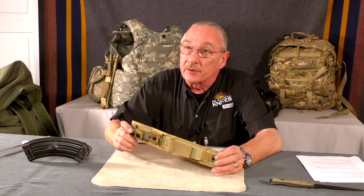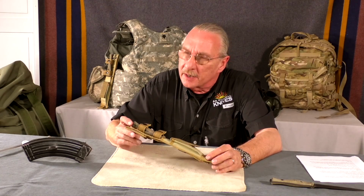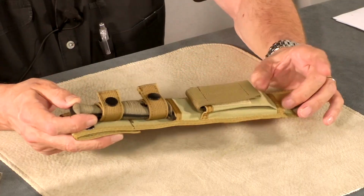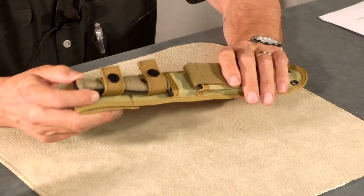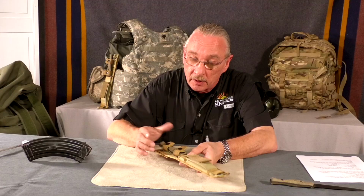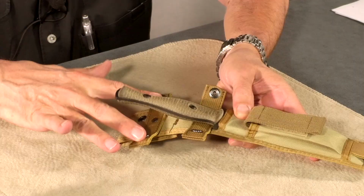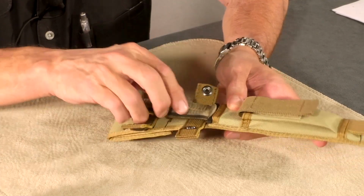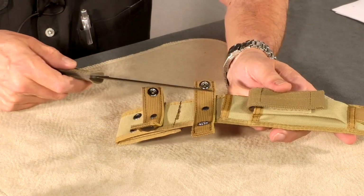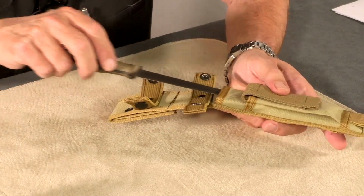The sheath is also a very important component of the knife, and A.G. went to considerable lengths to optimize this. There is a formed Kydex sheath in here that ensures there is absolutely no rattle at all. The retention straps employ shim stock so that they spring out of the way, so that you don't get any potential to cut the straps when drawing or replacing the blade.